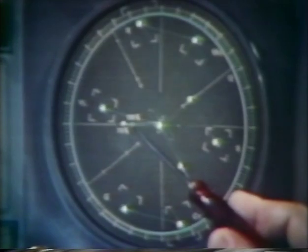The input signal of the local color bar should be checked to ensure correct color phase and amplitude. Saturation, as viewed on the waveform monitor, should be 75 percent, with chroma at 100 divisions. Phase is checked on the vectorscope with burst falling at 180 degrees and individual color signals in the proper small boxes.